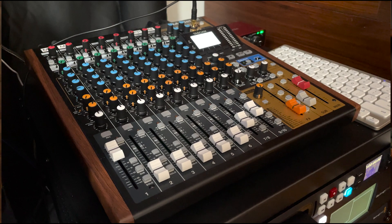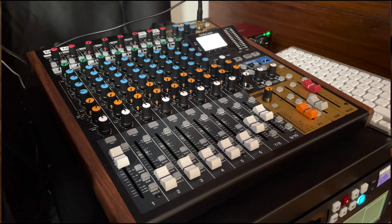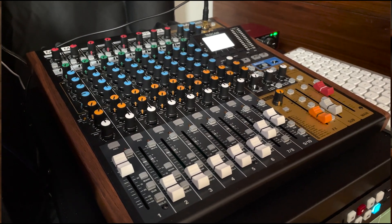Let's talk about our sound setup. We're using a Tascam Model 12 to control audio. We send both wireless microphones, ProPresenter, and Zoom ISO into the board. Then we use Aux 1 from the board to send a mix minus IFB signal to our host using a wireless pack, and we use Aux 2 from the board to send a mix minus back to the Zoom guests.